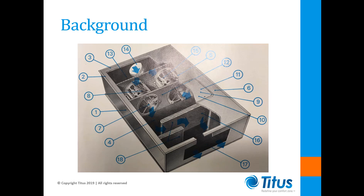Mechanical regulators would be located downstream from the damper or dampers. These regulator assemblies could take several forms. Sometimes a single regulator could be provided in a variety of sizes, and other times banks of smaller regulators were provided in sufficient number to handle the total air flow of the unit.